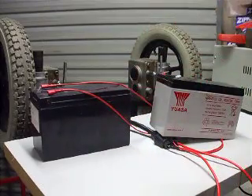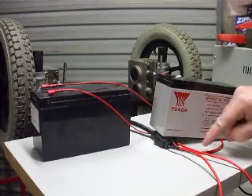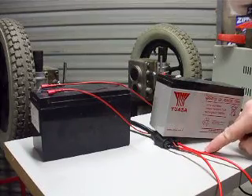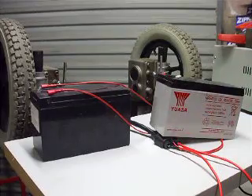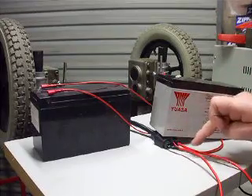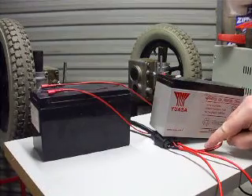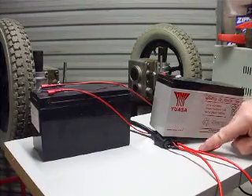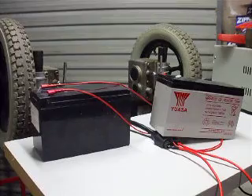The main thing here is: yes, the brake can be energised, turned on and off by applying the voltage on these two wires, and yes the motor goes backwards and forwards. Never try to get the motor to work without taking that brake off - I don't want to try it but I can only imagine that it can't be good.